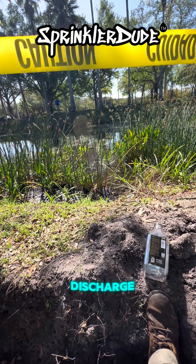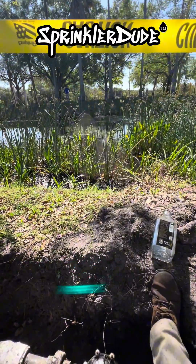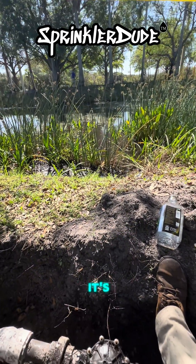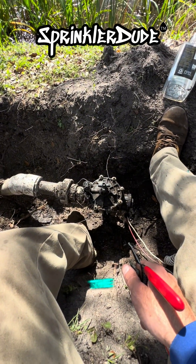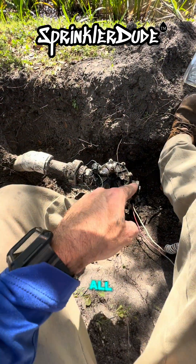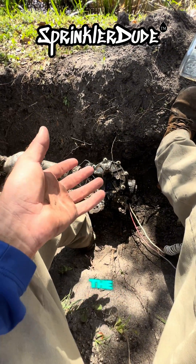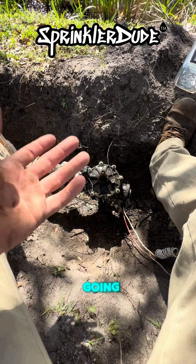There's a discharge into this little retention area lake right over here, and that's where this pipe goes — it goes into this retention area and across to the other side. It's broken, which is why it was just draining right there — all the water just drained through. Now I can take the valve apart. Now that the water's leaking through, I'm going to go ahead and take all of the bolts off. This will end up flooding the hole, but that's why I dug the hole in the first place so that debris won't go back into the valve.